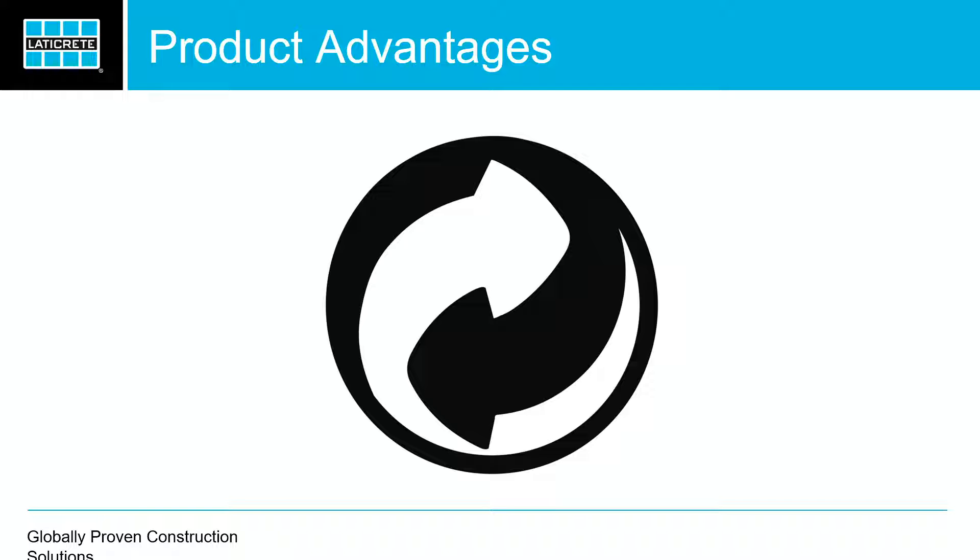Then you can wait two, three hours or even a day, honestly. The key for the next wash, after you dress those joints with a sponge, is this tool right here — a doodlebug, a nylon scrub pad. This is the key to eliminate any haze no matter what you're working with. This is the second wash. Lightly, very lightly damp — it'll take off all the haze. It'll disappear. Follow it up with a microfiber towel and you'll have a perfect installation.